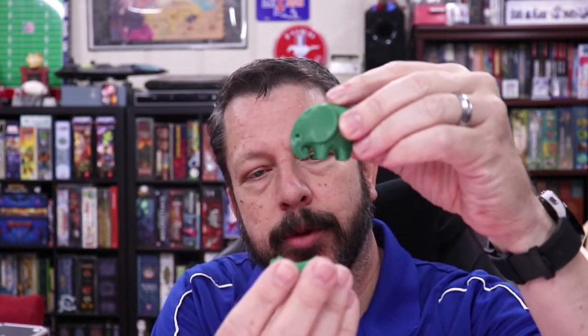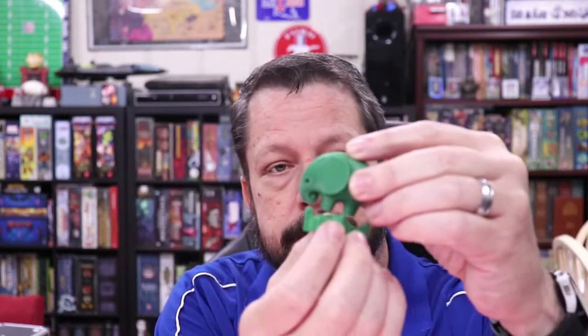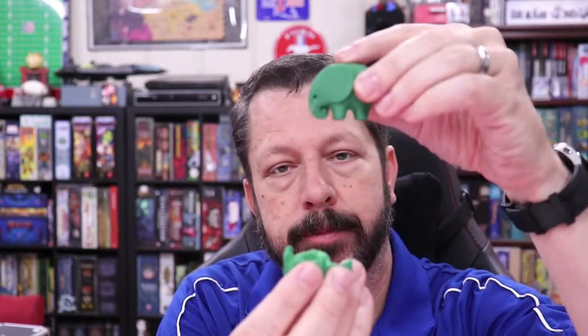I did assemble our printer, so I printed this little guy. It's a little elephant. This part is the support material on it, so you can print things that you think you wouldn't normally be able to. Maybe it looks like you'd have to print in midair or something like that. You can tell your slicer to add support, so that anywhere there's going to be a part just hanging out in midair, it prints a removable support that can hold it temporarily in place, and then you break it away. This is a breakaway support, so you break it away later.